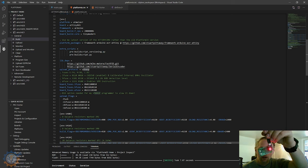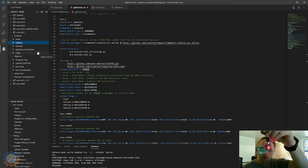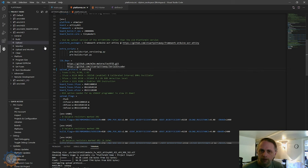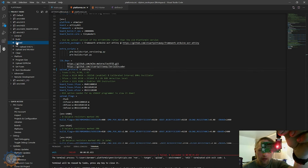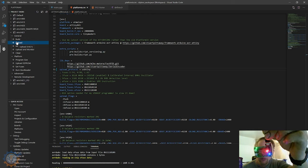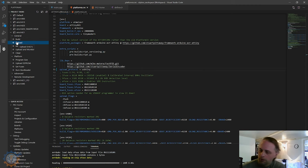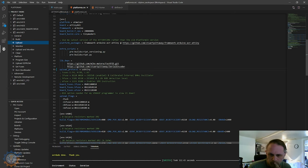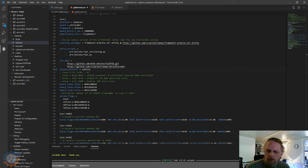Take your device and press upload. If the correct device is chosen, it will go green at the bottom. If not, it will show an error saying it could not find a USB device. In that case, go in and change it to USB Tiny, save the file, and press upload again. Hopefully it will work out — and this device will now start blinking green, which it does. You can see green and blue LEDs are now on and it is writing at the bottom. Beware when programming this that you don't have it hooked up to any battery — you need to program it standalone without the battery connected. When programming is done, it will also read back to make sure the data is not corrupted, and it comes up as success. Go ahead and program all your cell modules like this.